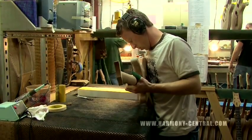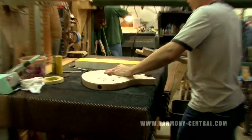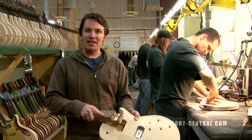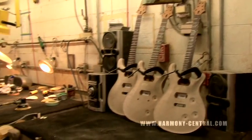The most important thing we're going to do is set the neck angle. They run a straight edge down the neck, take a measurement — side, middle, side. Once it's in spec, they can pull the neck out, score the wood on the neck and in the body. They ladle a bunch of glue in here, pop the neck in, clamp it up, and it sits overnight for the next stage, which would be finish sanding.